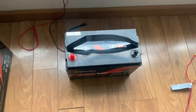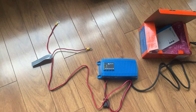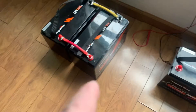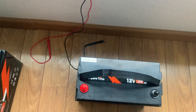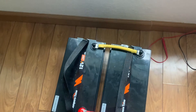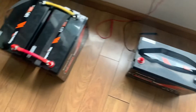Finally, this battery has just completed its charge — that was about six hours of charging because it was interrupted. Don't know why, there was no loss of power here, but the charger reflected an interruption on both. Now it's done, showing 13.68V — they took it down from 14.2V. These other two are both still showing 13.46V. So as soon as this one drops to 13.46V, we'll add it to the bank and let them all sit for 12 hours.